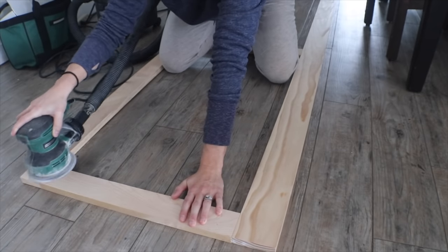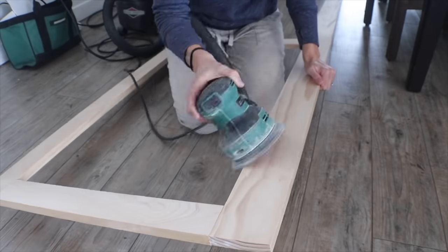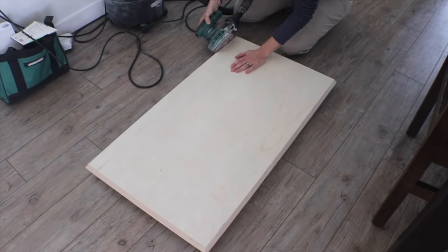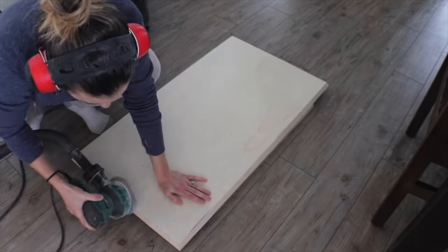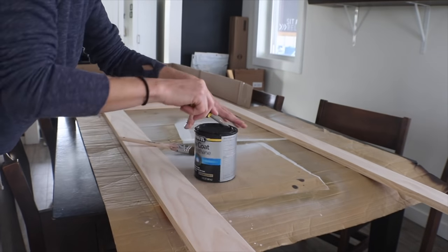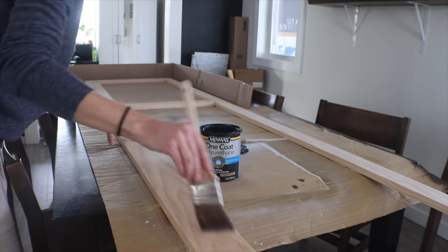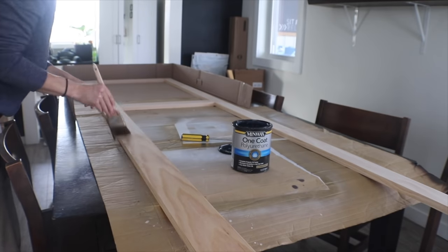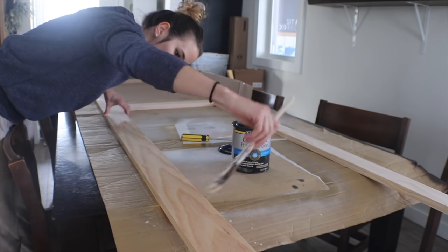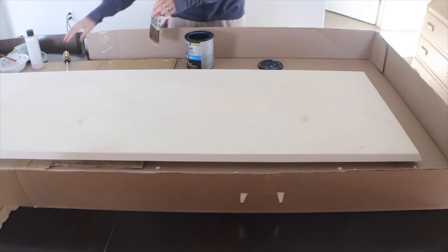Sanding took hours. I sanded the face frame multiple times — most things got sanded to about 150 grit. I also sanded all the doors and all the edges so they were a little bit softer to the touch and not perfectly sharp 90-degree angles. After sanding I wiped everything down with tack cloth, then placed it on some cardboard to put poly on it. I've been using this oil-based polyurethane a lot lately and I'm quite impressed. I applied it with a fine polyester bristle brush because I had so many edges on the face frame. It's really durable with just one coat.